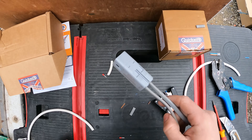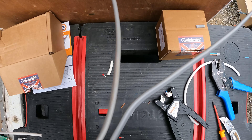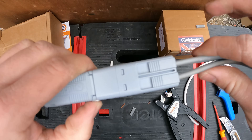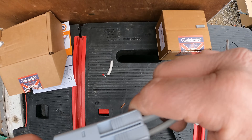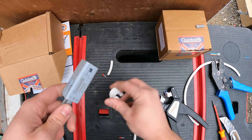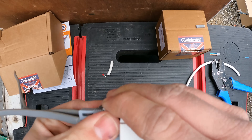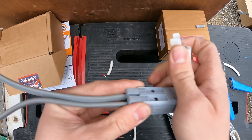And that is so, so much quicker and easier. It fits through like a 32mm hole or something when you've got your switch wires in and out. Then you plug them together like that and it's above the ceiling. They plug in and out very easily. Perfect if you're first fixing as well, just leaving that hanging down — you could leave the lights turned on and stuff if you want, waiting for the plasterers to finish. Each order comes with this removal tool to get them back out. It's as simple as lining it up with the sides, pushing it along, same again on the other side — and they just come back out.